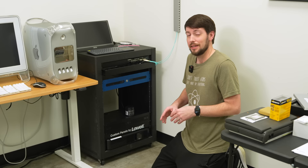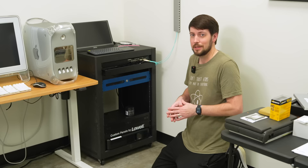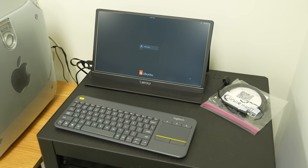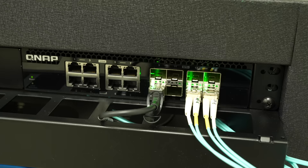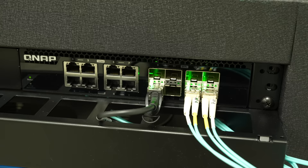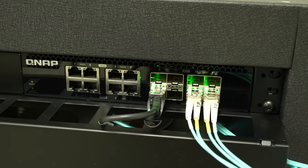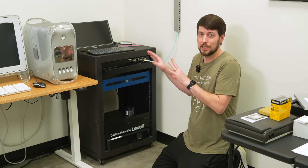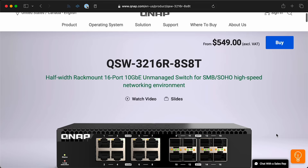I also have some newer tech in this rack in the corner. I finally lit up the fiber that runs back to the rack room and I'm starting to build out the networking in the office. The switch I bought for this rack is the QNAP QSW-3216R-8S8T-US — yeah, that's a mouthful, but it's a nice little switch. It gives me eight RJ45 Ethernet ports, so even an old Mac can jack right in at gigabit, plus eight more SFP+ ports great for fiber, direct-attached cable, or more RJ45 with the right adapters. If I need more ports eventually, I could buy a second switch — QNAP even makes an adapter to put the two next to each other. It's a quiet switch and it looks great, so nothing to complain about except maybe price.